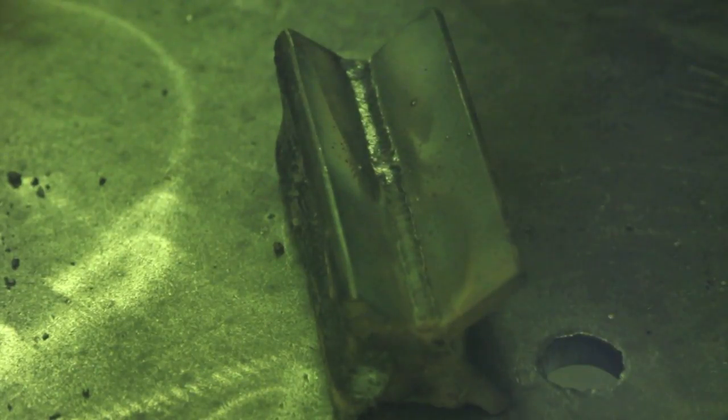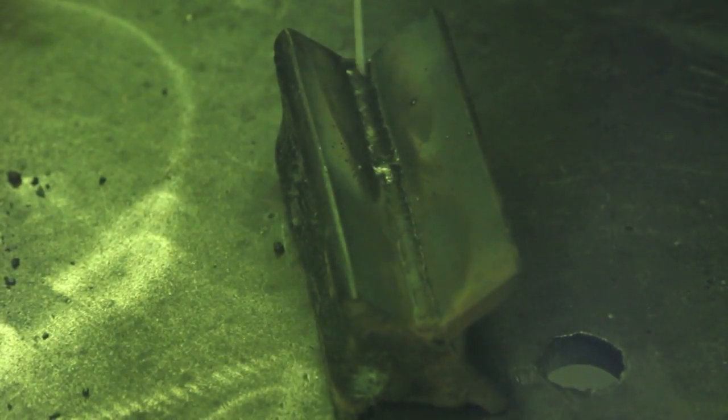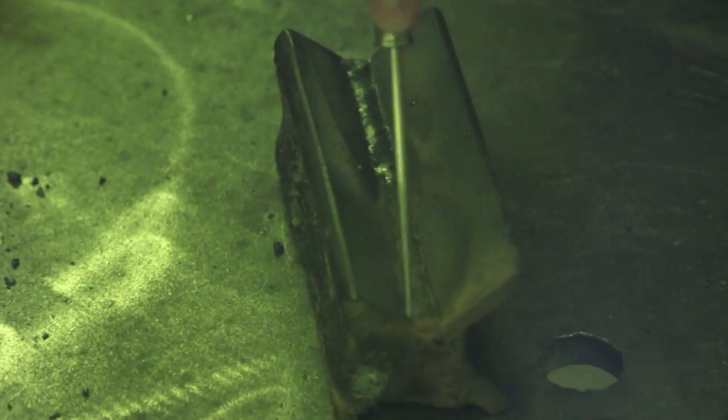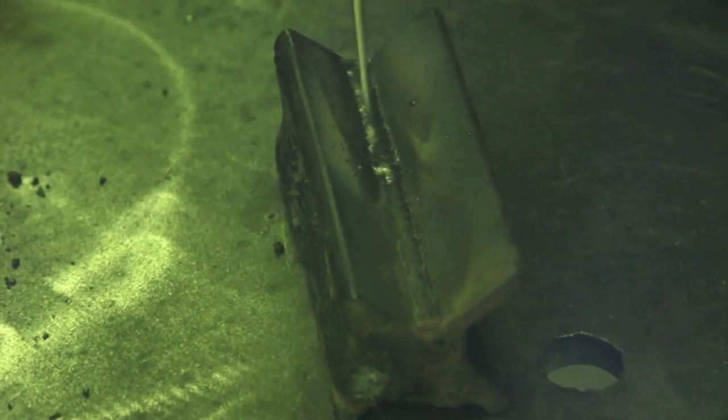I have the pass I just made and, as you can see, I tied into that previous really badly welded pass. I'm going to up the amperage. This pass I made at about 115 amps, which was really good for this thickness — the steel here is a quarter inch thick, but remember the whole thing has been practically welded up underneath, so it's almost like a solid piece. What I'm going to do now is weave over this side to side to fuse it all together, eliminating this problem and melting that bad weld back down.